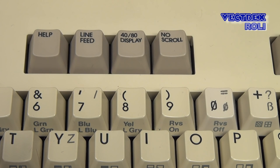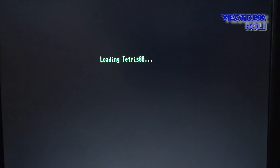In C128 mode you could use either the standard 40 column mode, or you can press a key on your keyboard and switch to the more professional 80 column RGB mode if you had the right monitor for that. There are two separate video outputs for 40 and 80 column mode, so you either use two separate monitors or a single one that can handle both.